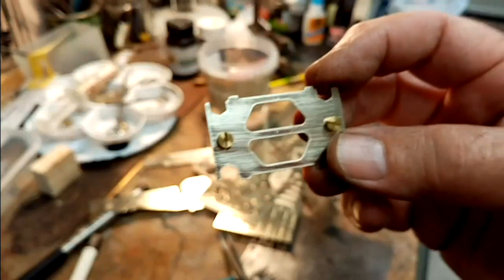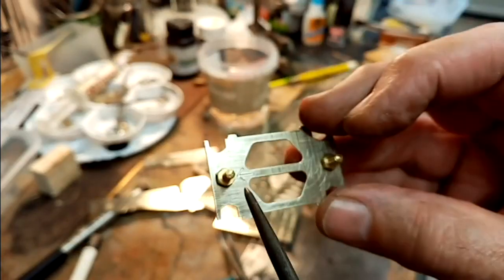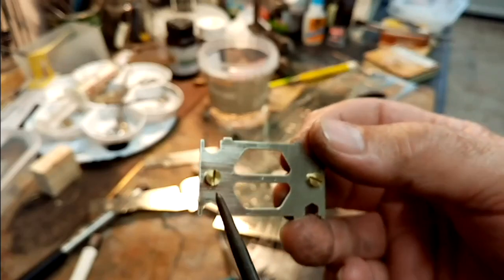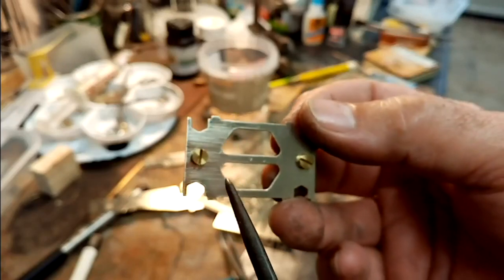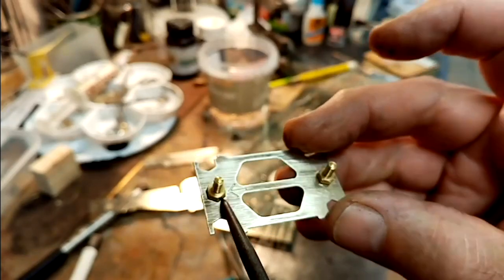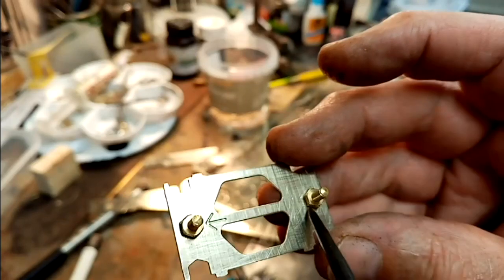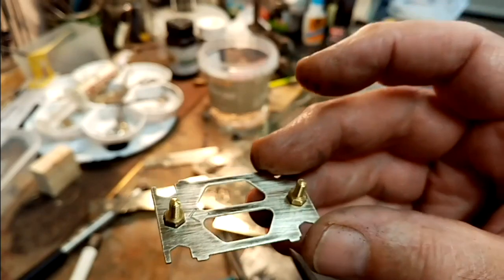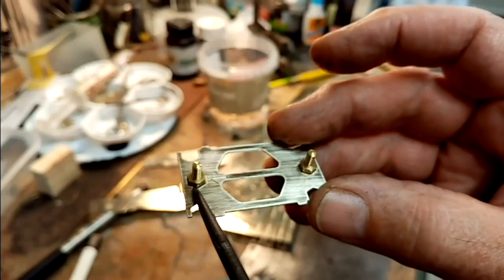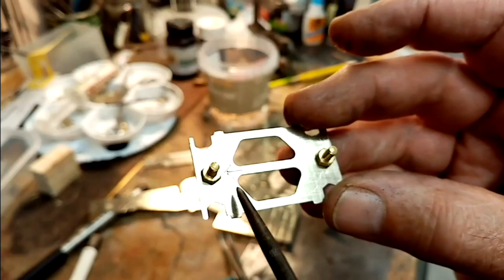This is one of the spacers. Just a tip here. This one is number H, and you've got to solder two 6BA nuts in. What I do, and I think it's again something that Bob Alderman pointed out, is if you put your screws in tight, screw the nut down tight, you can solder around it without the solder running through to the nut. The alternative, I do have some steel 6BA screws, but I've never really had a problem with it soldering up.